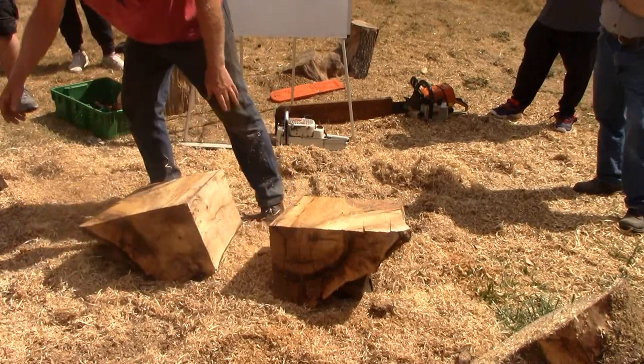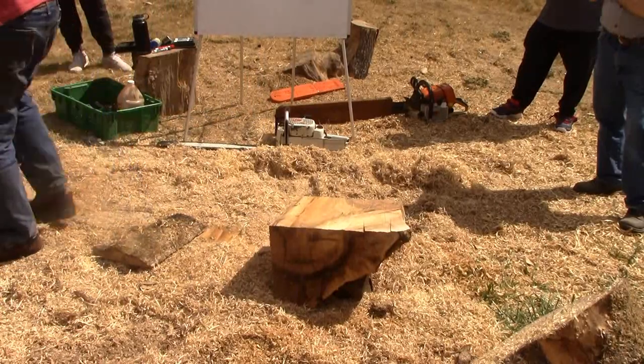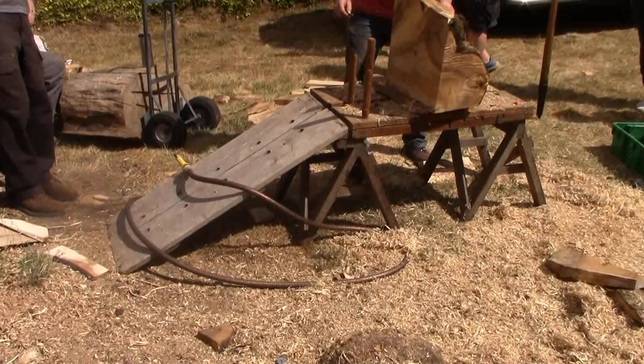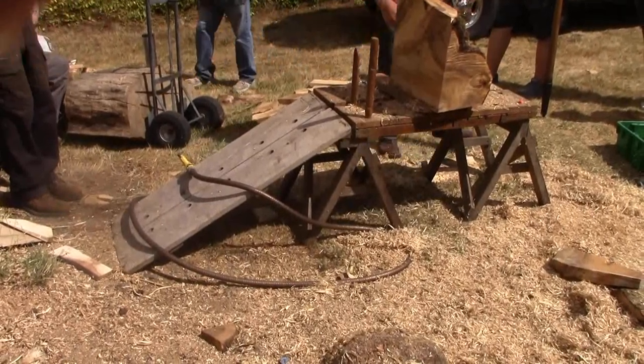If you don't coat the feather, you get all kinds of little cracks. This wood will crack today if we don't seal it. That's a beautiful one. And then I'm just going to cut this parallel here for the next bowl blank.